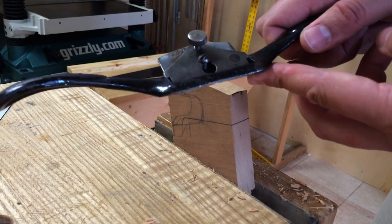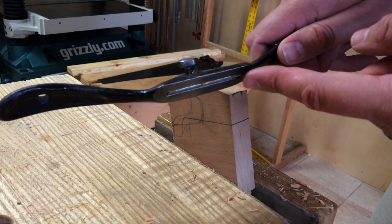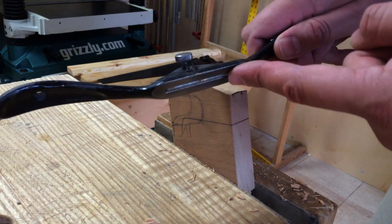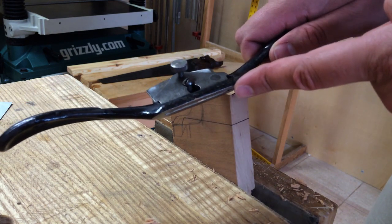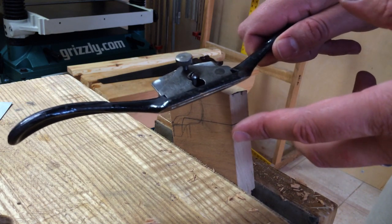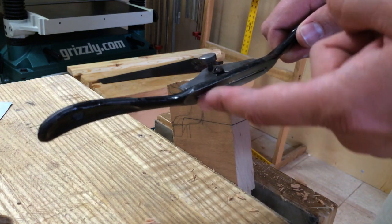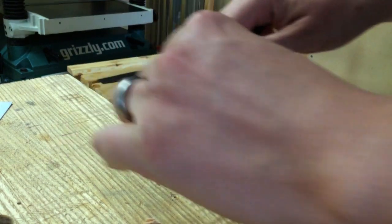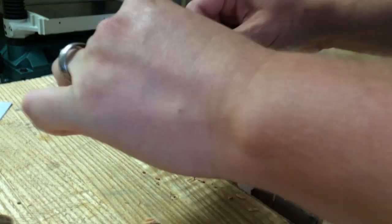Me, I don't want to keep it parallel to the sole. Generally I will have the shave taking a heavier cut on the left and a lighter cut on the right. As far as why heavy on the left and lighter on the right, that's just personal preference for me. The key I suggest is that you stay consistent with that. So now I know that I can take a much beefier cut over here and then come back with the right side and refine that.